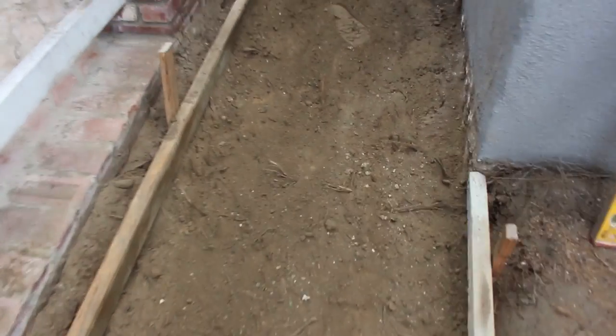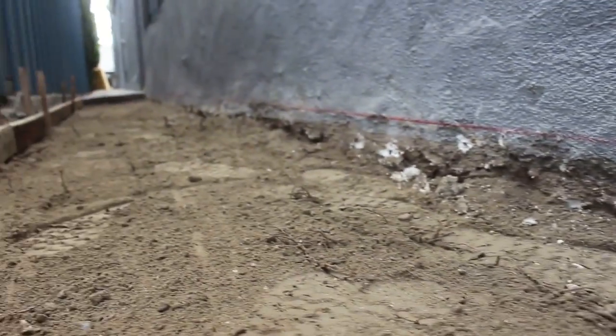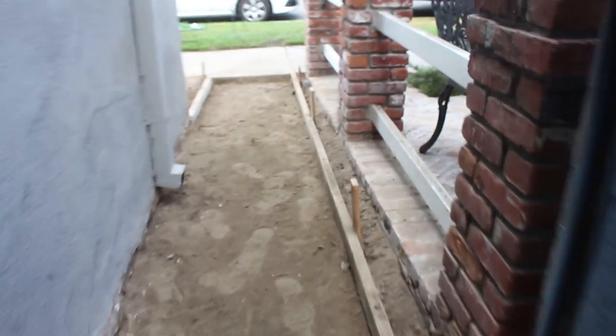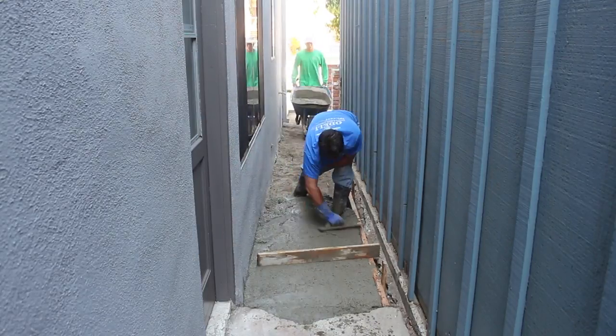We've removed the dirt now. For elevation, we want the concrete below that downspout so the water can come off the roof and go somewhere — that was one fixed elevation. We also have a joining sidewalk at the other end with some stepping stones. We're going solid concrete since it's a lot less maintenance. We leave a little gap between the two properties for water runoff and in case anyone wants to put a fence in — you'd still have space to get posts in there.